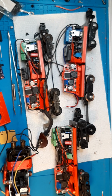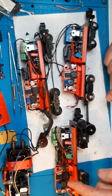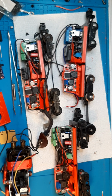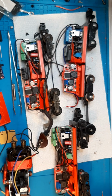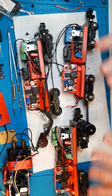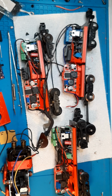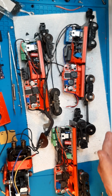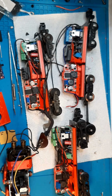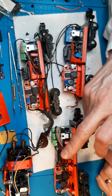But at 8 volts, everything runs cooler, and I can adjust the output to, I forget, at the highest speed the smoke needed just under 6 volts, or 6 volts is all I needed out of here. So if I have 8 and give it 6, that's 2 volts overhead for this board to manage that 5 volts, and it works. This guy does not get hot. These guys don't get hot. It's like a balancing act: if you push in 10 volts and you're only using 5, you've got to waste the rest, and it does that by turning it to heat. Wait a minute. My little diode was hot. Diode was probably fine. I was pumping almost 9.5 volts into this guy, and he only needed 5.